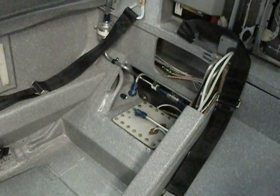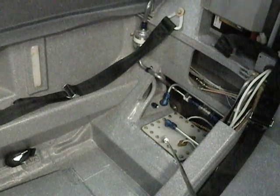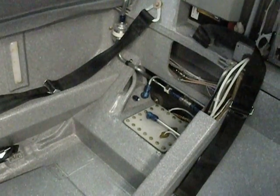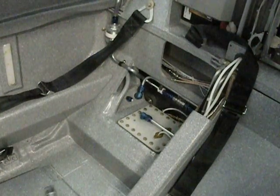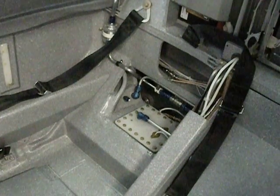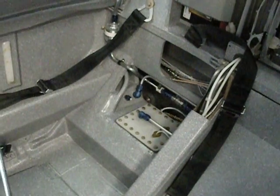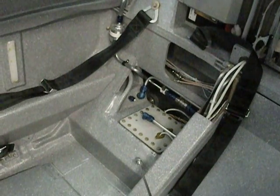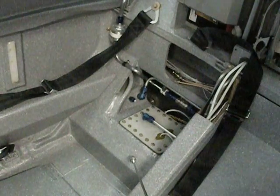There's no selector left and right. Inside the fuel tank here, under this panel, you can see this metal plate — I have two submersible automotive pumps. They lie at 45 degrees and attach to the plate. There's a fuel sock which is a pre-filter. So fuel comes in from the wing tanks, fills this sump, then goes through the two pre-filters and two pumps, and I can select one or the other from the instrument panel.